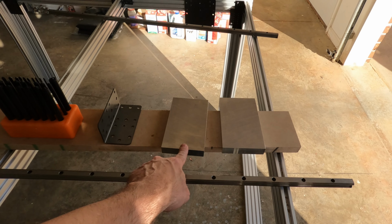And we have all of the corner brackets bolted in place, all six of the leg brackets, I guess. They're all six in a corner, I guess you would say, but everything is drilled through and bolted solid, sandwiched together. I have the bearings here, these floating bearings mounted solid. I have the plate here for the rear bearing support, or the ball screw support, mounted. And I have drilled through and put bolts to keep that from being able to slide. You can see these here on the other side. That is bolted securely in place where it should be located. And that wraps up the table assembly, short of the ball screws, and we'll add the ball screws later.